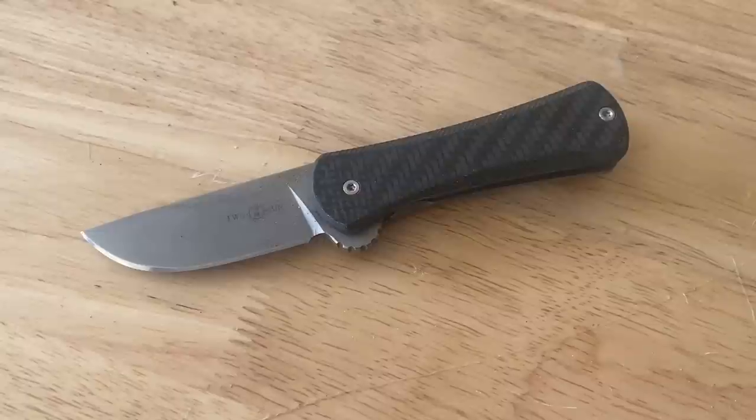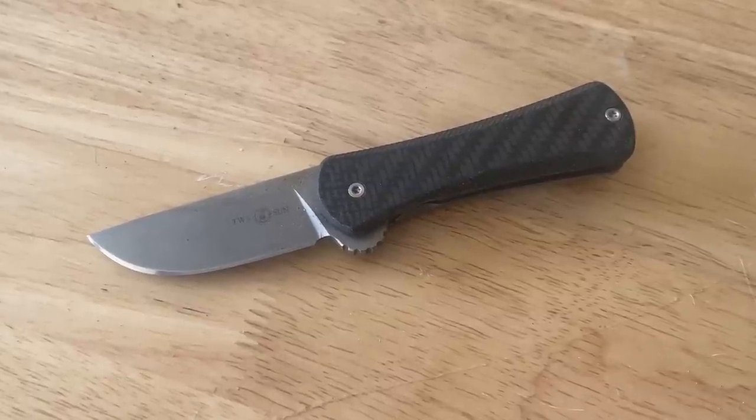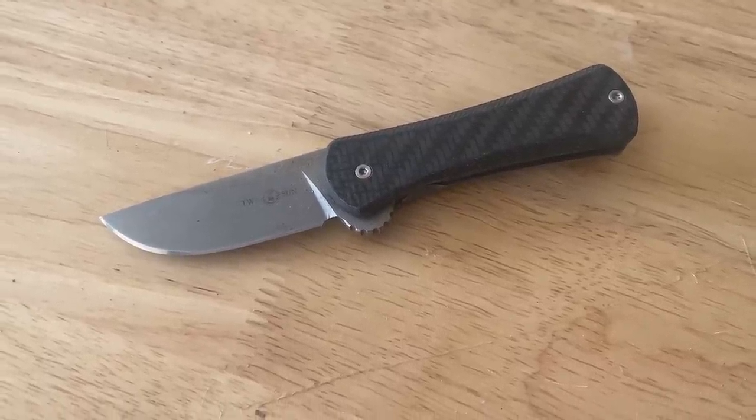Here is the Tucson knife — a really cool design, but I remember the steel: this is supposedly S90V, but it's not really done very well because it doesn't cut like S90V. It cuts like S30V, which is about half as much as it should. I did my steel test several times and just couldn't get it to cut like S90V could. I'm not all about calling things out and making big to-dos, but I've done enough knife tests that when I do pick up on something behaving weird, it's generally likely something went wrong in the heat treat stage — or as we found with Bark River a few years ago, it was mislabeled.